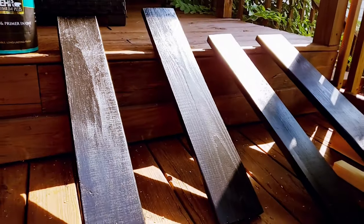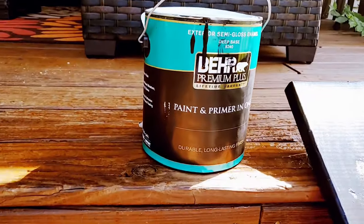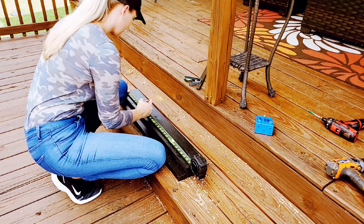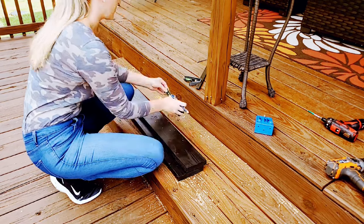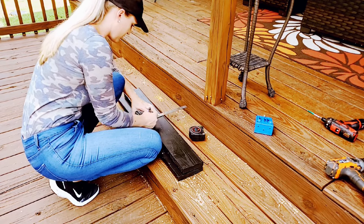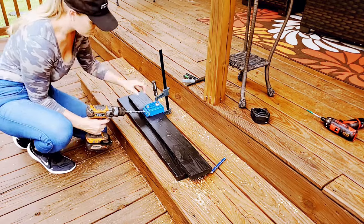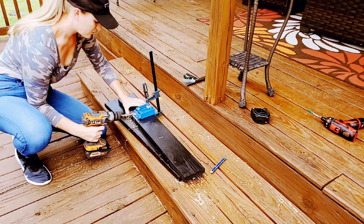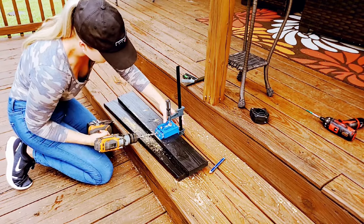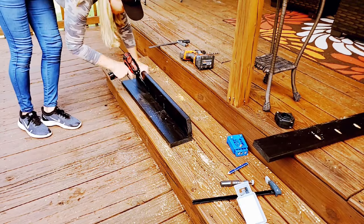Next, it's time to work on the legs for the garden box. First, we painted each of the legs using some leftover exterior paint from our fence — this step is completely optional. Now I start to assemble the four corner legs. All of the legs were cut to 32 inches, with four then being ripped by one inch to be even on each side of the garden bed corner. To create a corner leg, I first measure three holes, use a jig and a clamp to pre-drill three pocket holes, then square up the two boards to form a 90-degree corner leg and drive the three screws in.